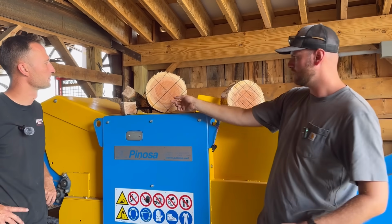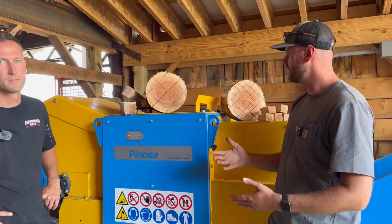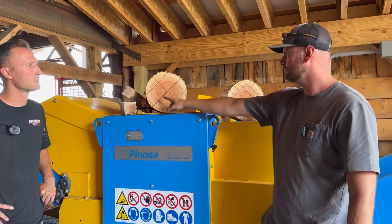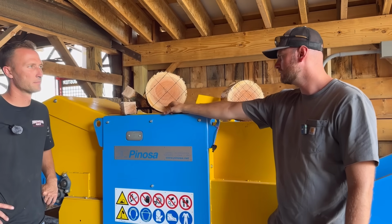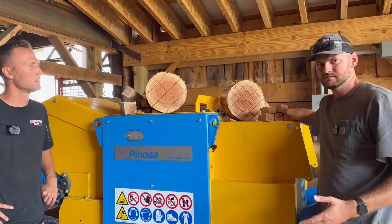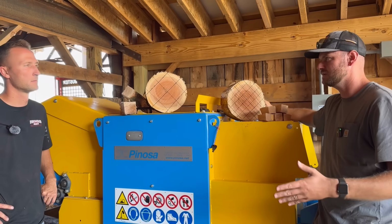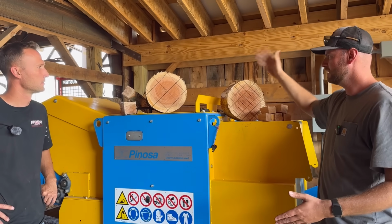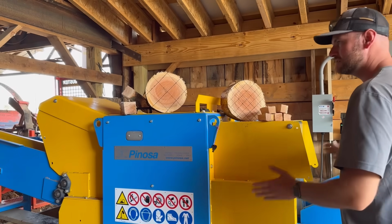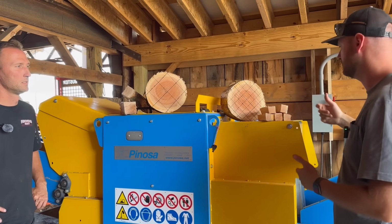And then to go in and make regular 16-inch firewood that would be good for, you know, your indoor wood stove or fireplace or campfires, you just change the settings from 1.5 inches to, what was this, 3.5 inches? 3.5, yep, 3.5 inches. So very simple concept of how it works, obviously much more complex in how it's manufactured, but from cutting the wood, once you cut the wood and load it in the hopper here, this does everything else. The biggest challenge you have is just keeping up with the outfeed of where you're putting it.